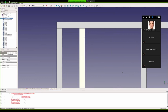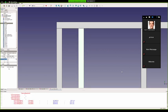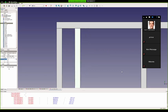What do we have on the first floor? We had the thickness of the top plate, because it was sitting on the top plate. So what was that? 5.5. Here we're adding a 3/4 inch. Why? Because we need something to attach the ceiling to. Otherwise we would have nothing to attach the ceiling to. And we have to put up blocking there.